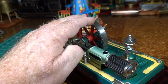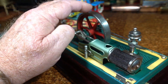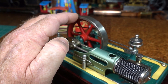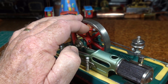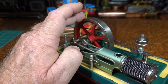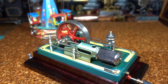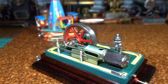What I've done is coated this multiple times with a very strong superglue. I did this around 2017, and looking at photos from back then, it hasn't got any worse. So it looks like the superglue method works. I'll probably give it another coat of superglue just to hold it together. But if you've got one of these little steam engines and the flywheel is starting to disintegrate with zinc pest, I would try the superglue method.